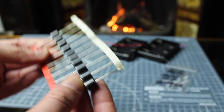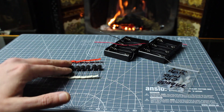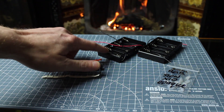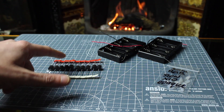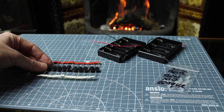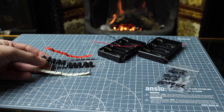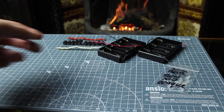What I wanted to do was have some power path management using some diodes - a really simple method of power path management. So having a battery and also a 5 volt input. The output would go into a 5 volt regulator and then I'd have a USB input going to the Pi as well. Using a couple of diodes it would use the higher voltage, so I'd have a slightly lower voltage coming from the battery, something like 4.8 versus 5 volts. The 4.8 is just within Raspberry Pi spec, but it would signal the Raspberry Pi to shut down. I didn't expect the diodes to be so massive.